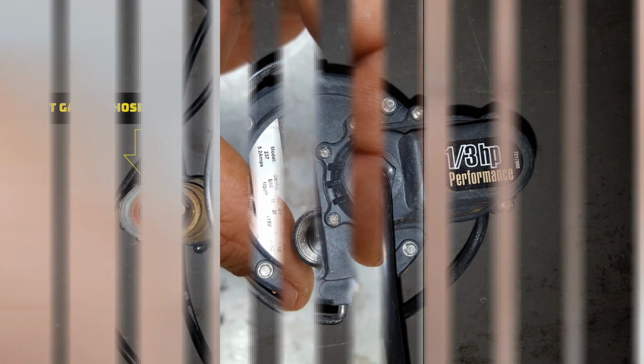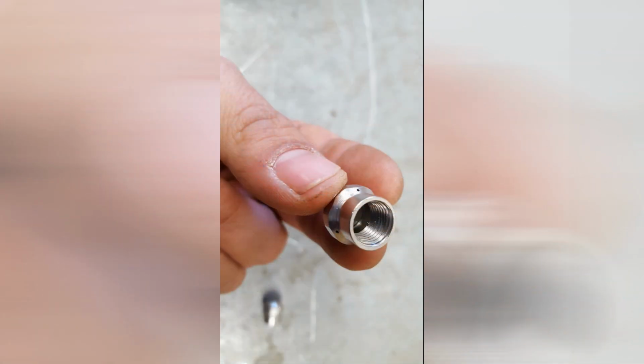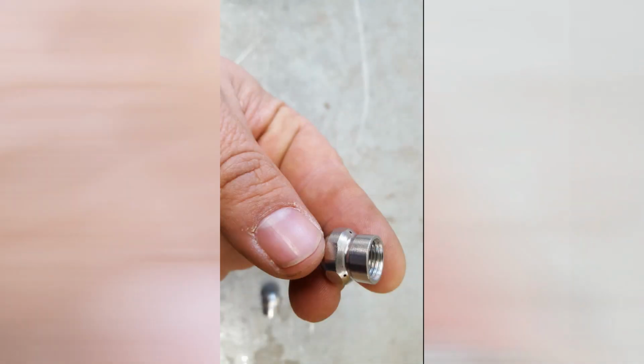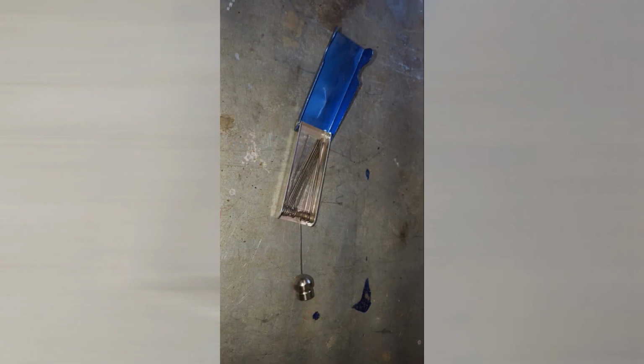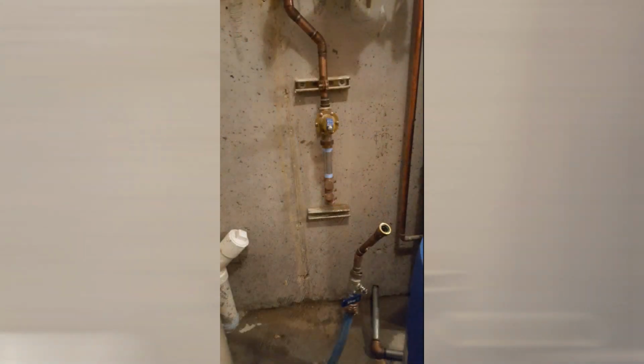The jet heads have 4 to 6 tiny holes. Eventually they're going to get clogged up, so usually every time before we start, we take a little welding tip cleaning tool and clean those jetting heads. Now you're going to want to disconnect the customer service line, leave that ball valve in place, and hook your bypass straight to the ball valve. If the customer doesn't have a ball valve, you might want to install one. It really makes things easy.